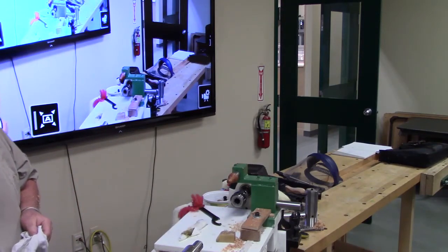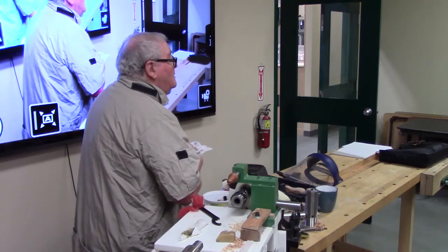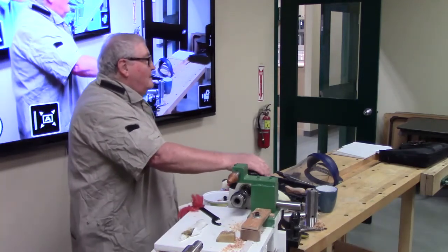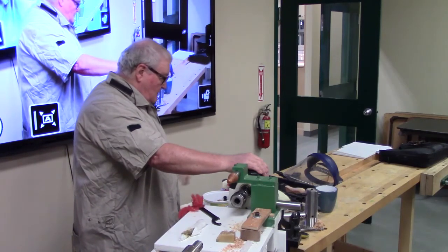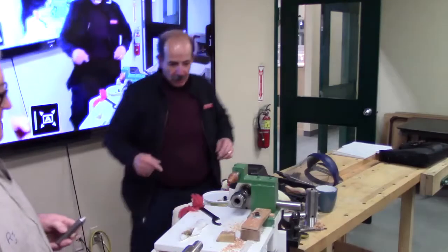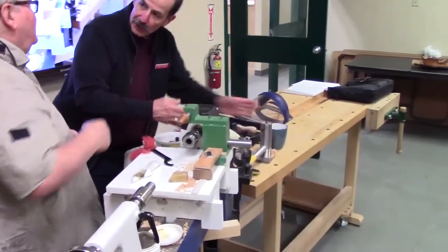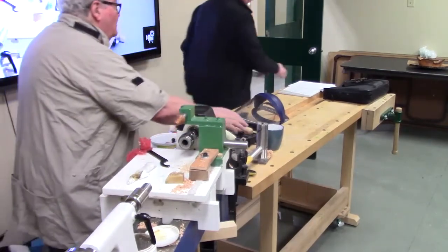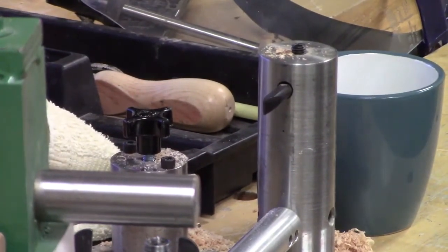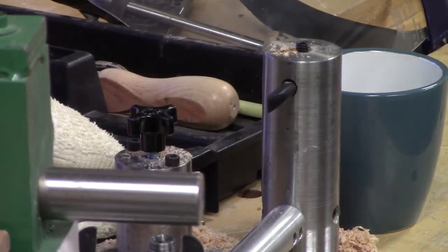Richard, I noticed on the other side of your guide that you're using, you got it cut narrower. Does that allow you to use narrower tools, instead of that scooter gouge looking piece that you've got in, which is quite broad? So if you want to do very fine things, the other end's quite sharp. Whatever shape tool you want to use, you have to have a stylus the same shape. And if you're turning acrylics, for example, you need a different tool. A flat top gouge works very good for acrylic, or a double sided one, like a skew, but with a round end on.